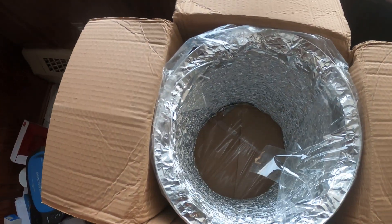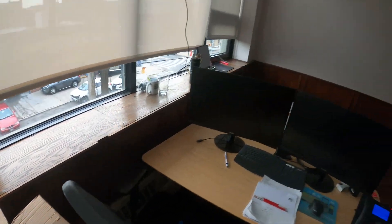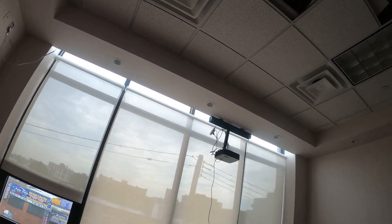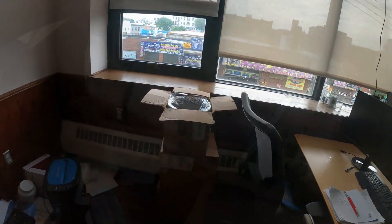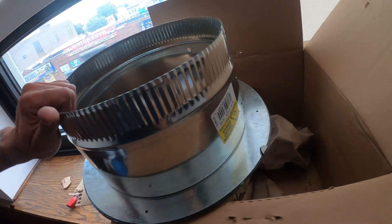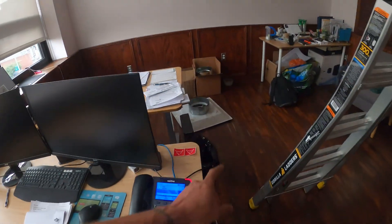Custom ordered some parts. Here's the flex — it is not insulated, which is not ideal, but it is what it is. We're going to work with what we have. This piece definitely bends so this is going to be an elbow. And here we have a 10 inch takeoff. This little gasket behind here is the part that's going to get mounted onto the duct. Drill a couple holes, takeoff with some flex into that diffuser.